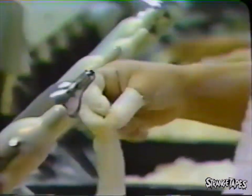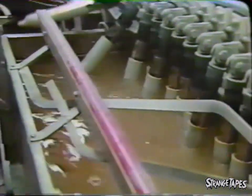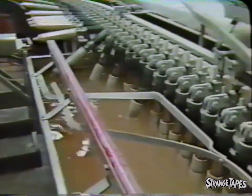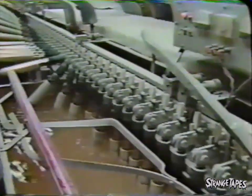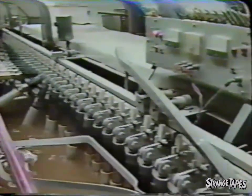This additional stretch enables us to pick out even a small pinhole. The condom and mandrel are then conveyed through a water bath where an electronic charge is placed on the bath to the mandrel. If the circuit is complete, then that indicates there's a defect and the condom is rejected.